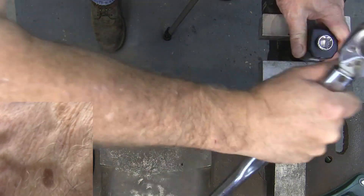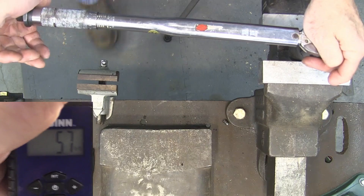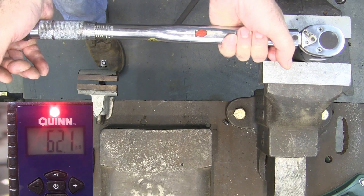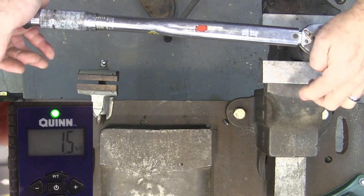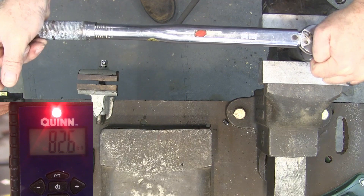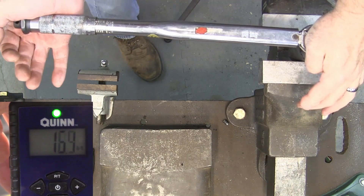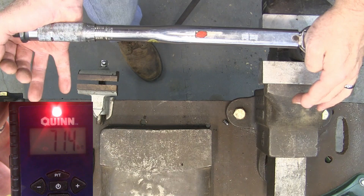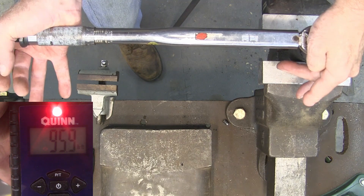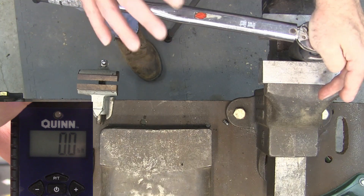Now we're going to go the other way. That's telling me it's at the set pressure, but it wasn't going off and I was at 80. That one beeps a little bit as you get close and then tells you you're there. Look — 80, 89, 90, 100, and it still hadn't broken off. So I'm thinking this one is worthless as a torque wrench. I may have to buy another large one like that.